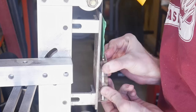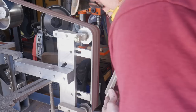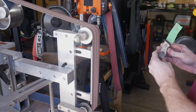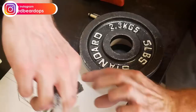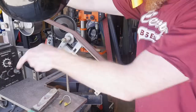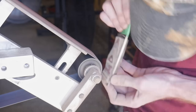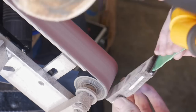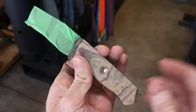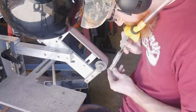The first step is grinding a taper towards the blade side of the knife - I think I could have gone a little further on this tapering. Before grinding in my hollows I went ahead and rounded the scales on the sides just a little bit. Using a five pound plate with an eight inch diameter, I tried to draw in some guidelines on where my hollows will be. I only have a two inch contact wheel, so I'll be using it to attempt an eight inch diameter hollow - it works out pretty good, but I do want to get some larger contact wheels.